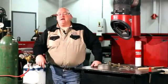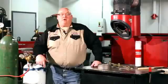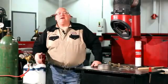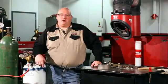Cast irons have around two to four percent carbon with a lot of silicon. The more carbon content you add to your metals, the harder and stronger the steel gets. But also it's very crack sensitive. So when we're working on cast iron with a very high carbon content, we have to start really following rules of welding and not just striking an arc on the material.